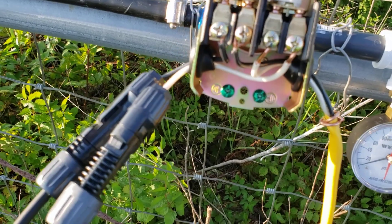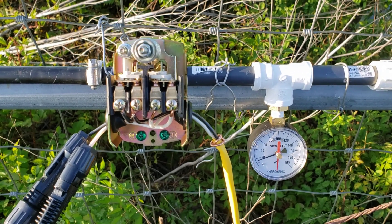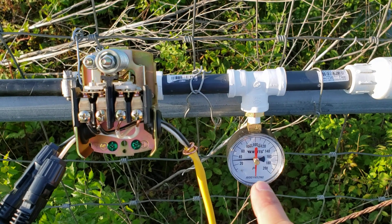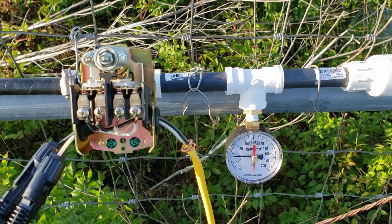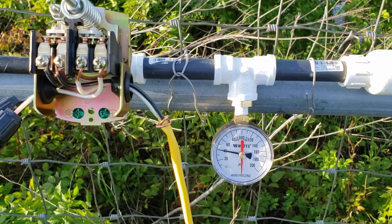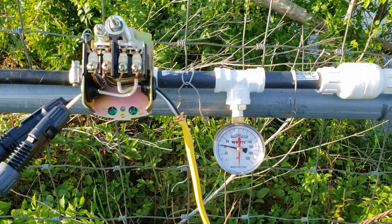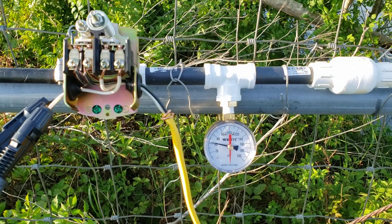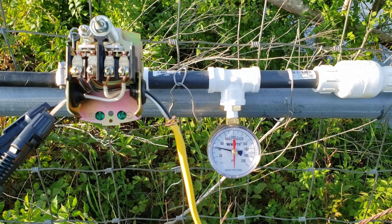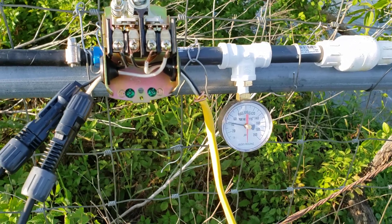Like I said, we're really losing sun, so I'm trying to get the most out of this I can. Right now we're pumping through the main switch that goes up top. As soon as that switch turned off, the pressure is slowly building — we're at over 30, about 35 PSI. Hopefully I have enough sun to show you this. We're up to 40. We may not have enough sun, but it's slowly going. I can hear the pump still running, but we just ran out of sun — or not ran out, but this panel isn't putting out enough voltage to fully run that pump.